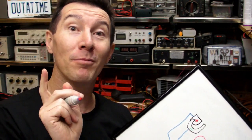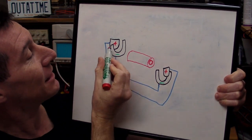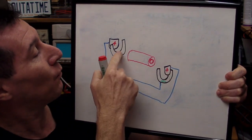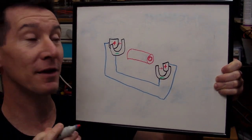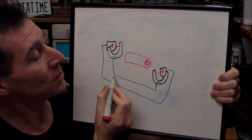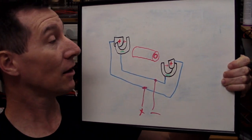Now, this technology isn't magic. There are a few problems with it, and here's problem number one. Please excuse the crudity of this model — I didn't have time to build it to scale or to paint it. It's got basically a positive and negative contact at each end. It's got that U-shaped one for the negative terminal, and then the inner one, set back a certain distance, for the positive terminal for the nipple. These two negative terminals must be shorted together, and the two positive terminals must be shorted together, and that goes off to your circuitry — there's your negative and your positive terminal.